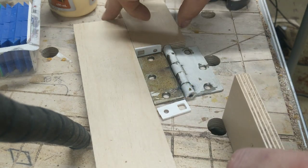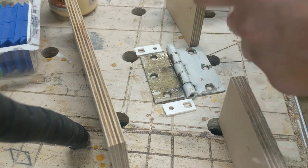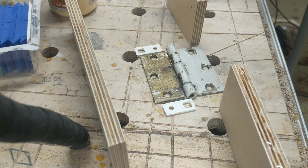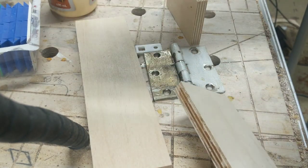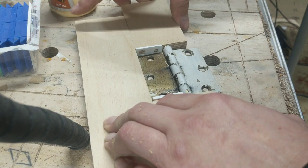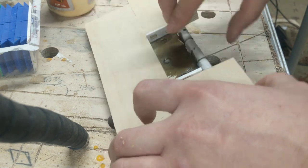So that's the shape I need. Now we're just going to undo all this and use some CA glue. I like to spray the activator on the piece first and allow the aerosol to dissipate so it's not a contaminant or doesn't form some kind of film that could weaken the bond — I've generally found this gives a stronger bond. Then with glue on both tops of these pieces, I'm going to put this back down. You can actually just glue this one on anywhere, it doesn't matter. While that's setting up you can get this ready, then squeeze that in, make that tight, and let that set up. Once it's set, you can pop your hinge out.